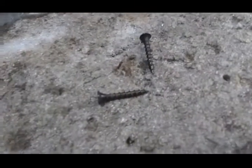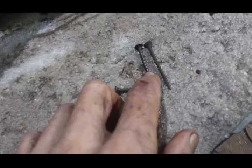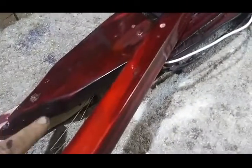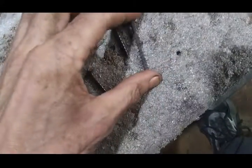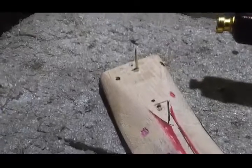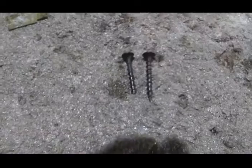For the front screw, I'm going to take a longer screw and cut it down so it's maybe a couple millimeters longer than the original, in order to make up for the shim gap — because the screw isn't reaching as deep into the neck now and it probably needs a bit more wood in the hole to grab. So I'll go for a slightly longer screw to get more grab, and I'll glue in some more toothpick, trim it off, and trim down the back screw.